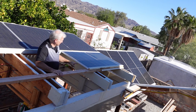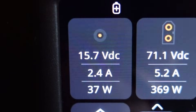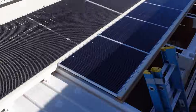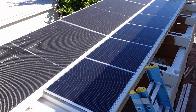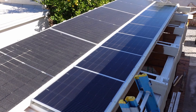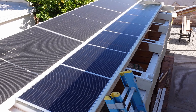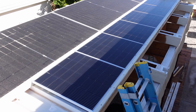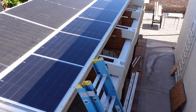I've got the first two panels in and they're all hooked up and working. Here we see them in full sun early in the morning producing about 40 watts, and about 37 watts on this one. Here is the first row fully installed. These last six are tied together in series. However, you can see by the shading that they're not going to be producing anything until springtime, probably sometime in February. The upper ones will be in full sun; I'll have the bottom row installed next.